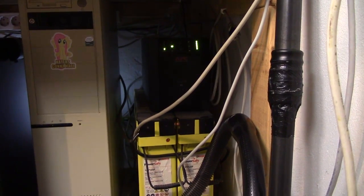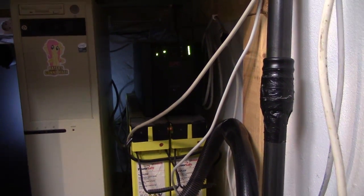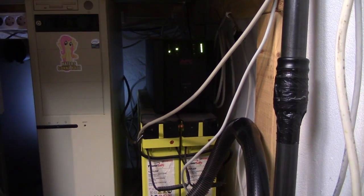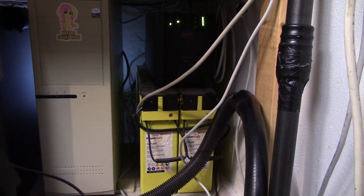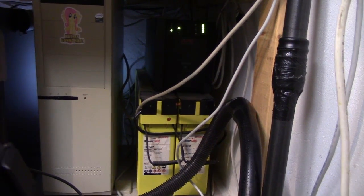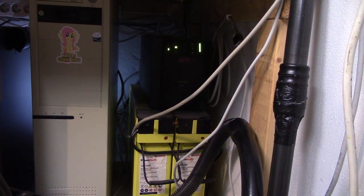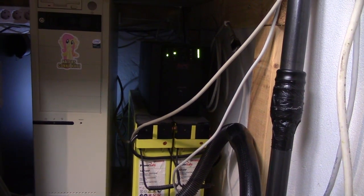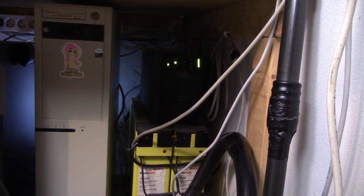The question remains what I'm supposed to do with my old UPS down here. I still want a local UPS in case I need to unplug the wire or move something around, but this thing could probably do with getting downscaled a bit, and those batteries down there are pretty crap — I wouldn't expect more than about 40 amp-hours each of usable power, so they really belong in the scrap heap. I'd also like to modify the fan control of that UPS so it doesn't run horribly loud under load. Right now there's just one dot so it's running passively, but if you put more than about 80% load on it, it'll start revving the fan, and that sometimes happens depending on what I've got running on the UPS at the moment.